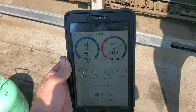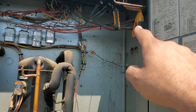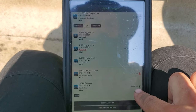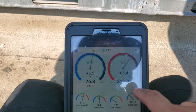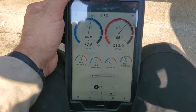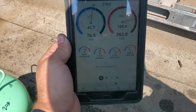My pressures are fluctuating a little bit. I was accessing liquid line pressure, so I went ahead and put a discharge line port on there. Discharge line pressure is 254; liquid line pressure is 210. Map the high pressure — 212. We have a pretty high pressure drop across that condenser which makes me wonder if we have a restriction somewhere. I wouldn't expect to see that much of a pressure drop — that's substantial. We're going to investigate that liquid line dryer. No temperature drop across the dryer.